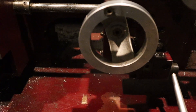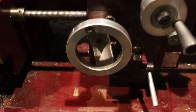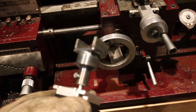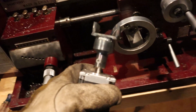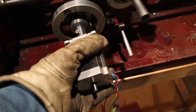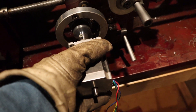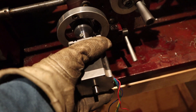It was difficult for me to find a good way to couple to this particular handle. The other one was pretty easy, but this one is a little bit more of a challenge. So using my lathe, I just turned down a motor coupler. The way this should work is it just slips right over the webs in that handle, and the spinning motor should spin that handle. And if it works, you should see the result of that right about now.